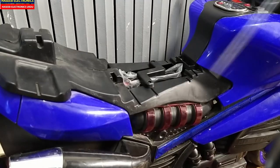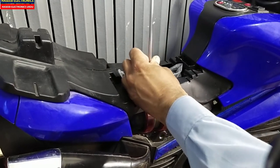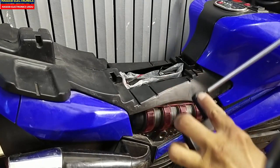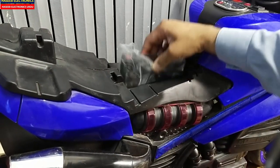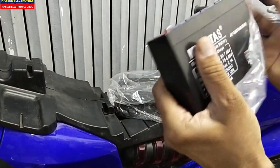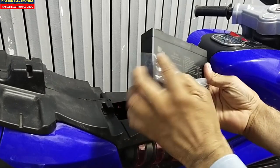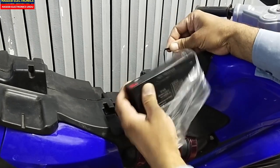Now I will replace the battery. For that I will remove this bracket — here are two screws for the bracket. This bracket and this bracket. This is our battery. Okay, this one is the new battery that is 6 volt 7Ah. The original battery is 6 volt 6Ah.